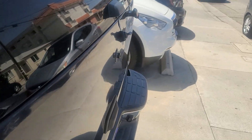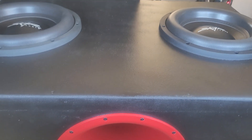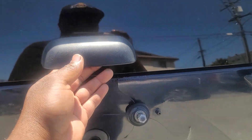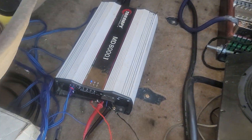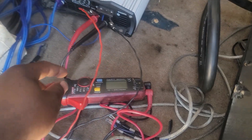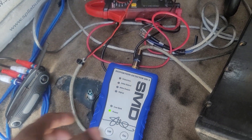I'll go ahead and show you guys — I've got videos showing this system with the two Scar Audio VXF-12s. This is a test I'm going to be doing right now. I'm going to try to find out how much output I can get clean — the max I can get. So I have my AC volt meter here, this is a true RMS volt meter, AC meter. And I also have the DD-1.